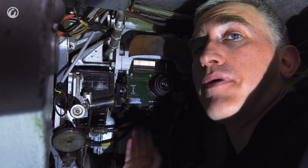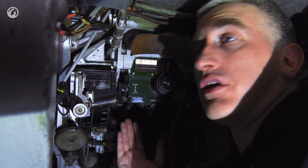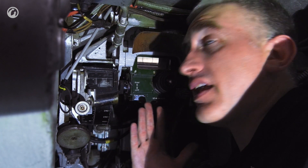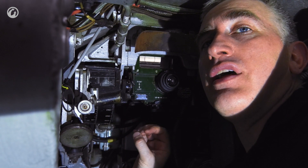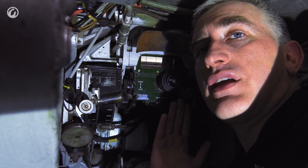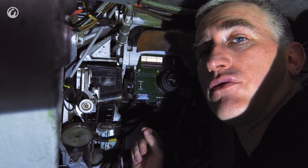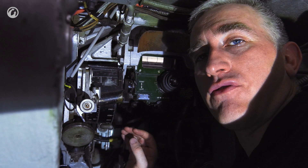This is the gunner's primary sight, it's a BI-8, and it is the only sight available to the gunner — not only the primary sight, it's the gunner's only sight. Most tanks would have an auxiliary sight located next to the gun itself, but it looks like there just isn't the room for it. It does have two optics within this sight. The first is a simple unity sight with a little circle showing your field of vision for the primary eyepiece. When you move down to the primary sight itself, you'll see that it is graduated for a ranging machine gun. The Mark Vs were not originally built with a ranging machine gun; it looks like this tank has had one added afterwards. There is no range scale inside the sight for the 20-pounder — it's just the caliber 30 and the RMG.